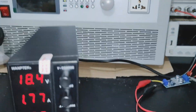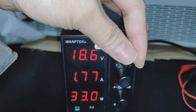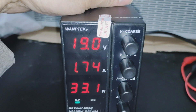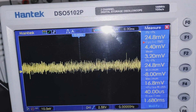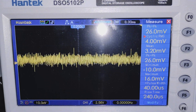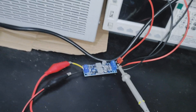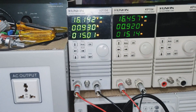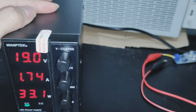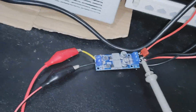The output is 16 volts, and we need at least a 3 volt difference for the ripple to reach its minimum. Now with 19 volts input, look at the ripple — it's lower now, back down to around 20 to 30 millivolts. So for a 12 volt output, you need about 15 volts input. For a 9 volt output, you need about 12 volts input. What's nice about this is each rail can be set independently.